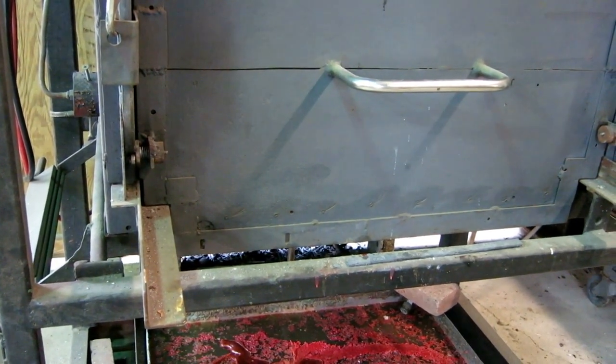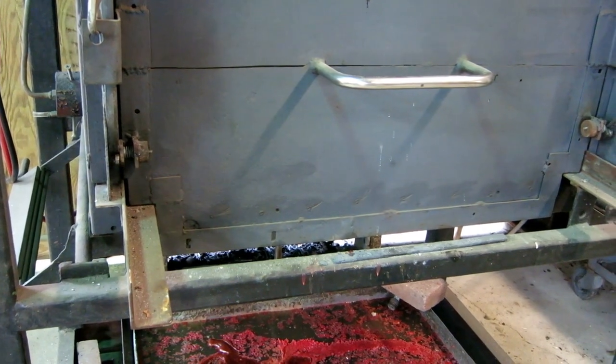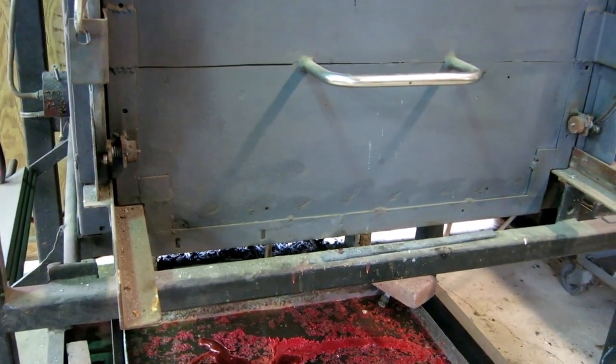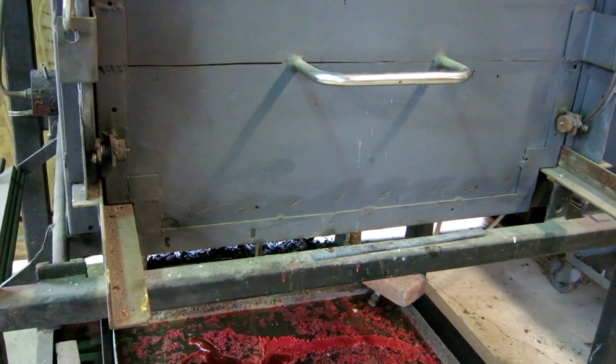What I've got to do is turn off the furnace, let it cool down a little bit, take the mold out, put some insulation over the bars, and then bring the heat back up. So I'm going to turn it off now, let it cool down just so I can handle the piece, and I'll show you what I mean in a second.